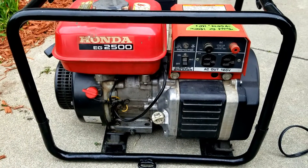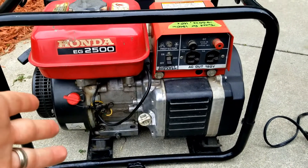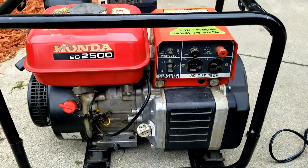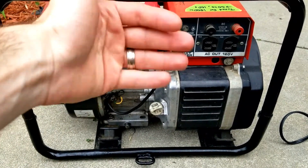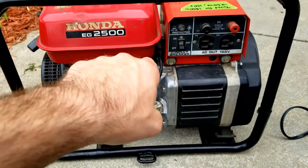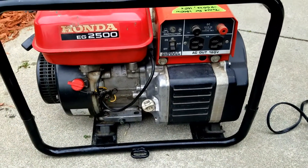If you're new to generators and powering devices, you might be wondering why a generator will fry your sensitive electronics. I mean, it's giving out the electricity so everything should be fine, right? The issue is that generators are not as reliable and they do not produce clean output electricity-wise like your wall outlets. This is a mechanical device, it has its flaws, and how you have it tuned will determine the type of electricity that you get as an output based on the load that you put on it.